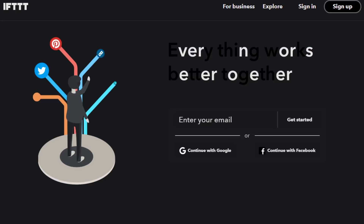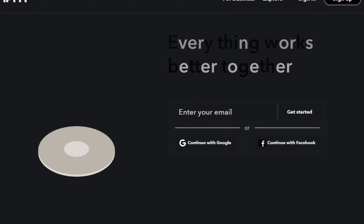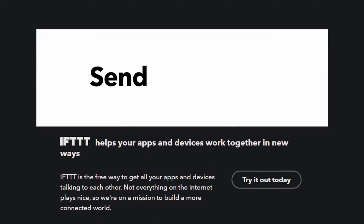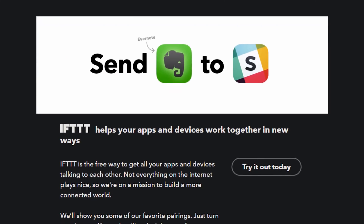When I get close to the lamp post at the end of my driveway, the lights can come on because the Raspberry Pi Zero sees me and recognizes the Bluetooth MAC address. That event is sent over WiFi to say, hey, probably need to open the garage or turn the lights on if it's after dark. Some people have fairly elaborate setups with another thing called IFTTT — If This Then That. Depending on your setup, you could tie in IFTTT with this setup, but that's going to be a subject for another day.